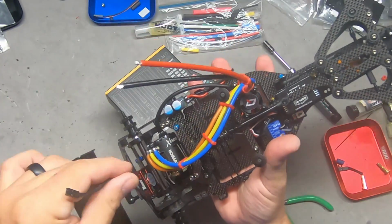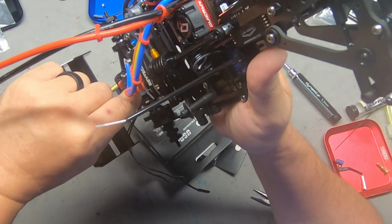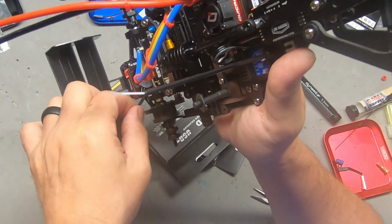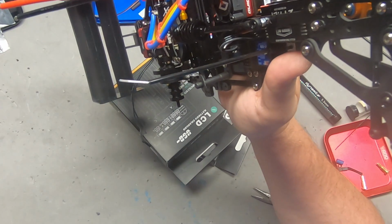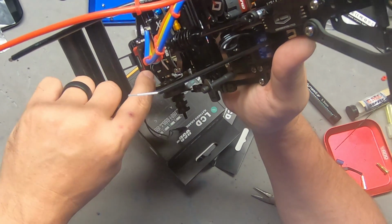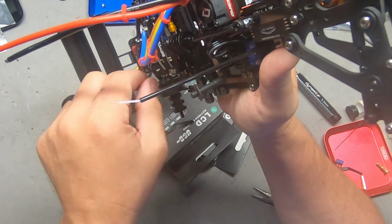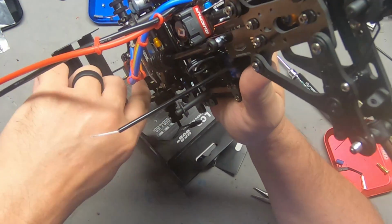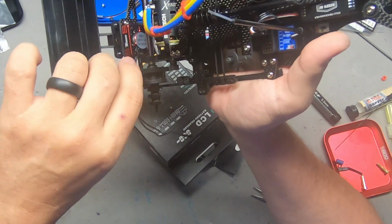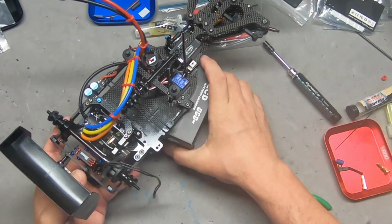One nicely mounted fan. Now, one of the things I did is the fan leads come out the side of the motor over here and go along the housing. There's a little L-shaped notch for them to tuck into, but they don't stay there. And you're never going to cut these wires and solder them that close. So I put a little drop, and I mean literally half a drop, of 5-minute epoxy into that little L shape, got both wires in there, and then capped it with another teeny bit of 5-minute so that the wires cannot just pull out and get themselves back into the fan or be any kind of issue. They're always going to be in place.